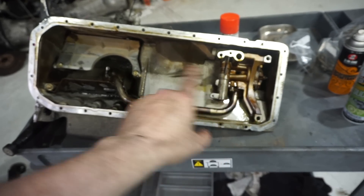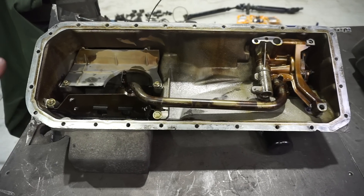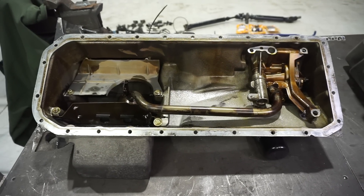However, under braking and turning into a high-speed corner, it all tends to drain toward the sump. What that does is give you the potential of running out of oil — sucking dry. BMW recognized this in their track cars for the LTW, lightweight, as well as the later generation Gen 2 E36 M3s, the EVOs.